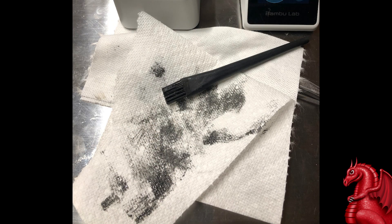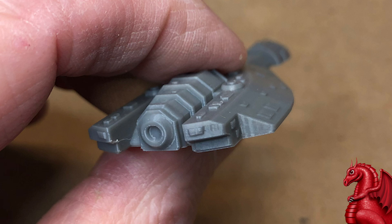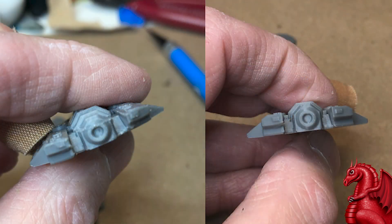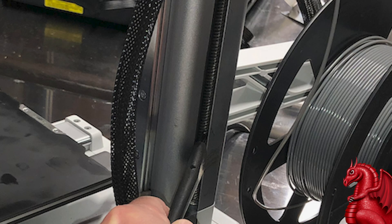Just doing that, I ended up with a ton of black gunk. I hadn't cleaned the screw in about six weeks; I'm going to go to cleaning the screws at least every three weeks now to prevent this from happening again. As you can see, the problem is completely resolved — there is no hang-up whatsoever. These prints look fantastic now, nice and smooth. Here is a before and after. This is my only real beef with the Bambu Lab A1 Mini: that Z-axis screw hidden in the housing. They did it to make the machine look nice, but it makes it tough to clean.